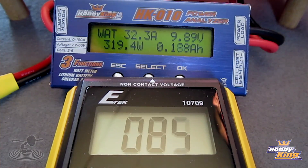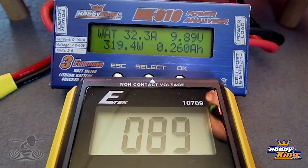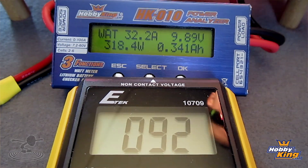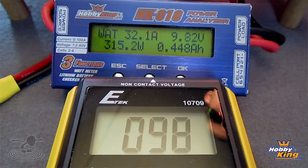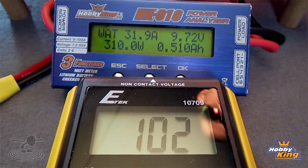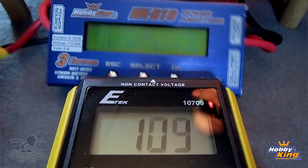How's the temperature? It's in the 80s right now, holding in the mid-80s. What's the amperage? 32 amps — it's actually performing really well. Wires are getting warm. The temperature's climbing up into the 90s now. What's the watts and amperage now? 32 amps. Still at 9.8 volts — it's holding at 9.8 still? Wow, that's really good. We're almost up to 500 milliamps already. It's holding really well. And I can tell you, these batteries have been used three cycles, both — they're exactly the same, just for this testing only. Still above 9 volts. Temperature climbing. Dropped below 9.